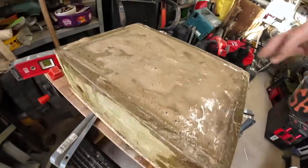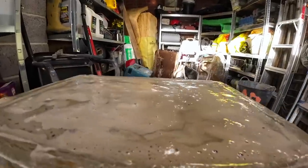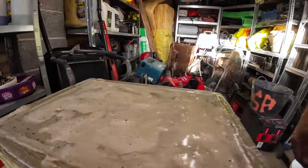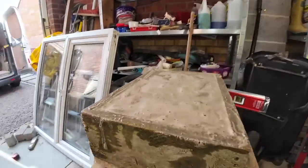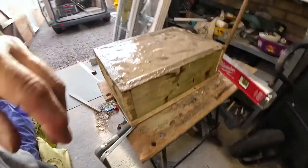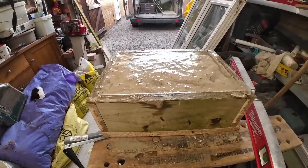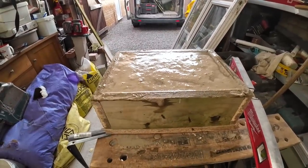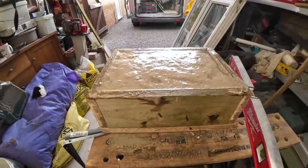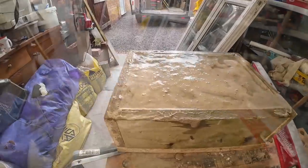The concrete was slightly above the edge of the mould before. If you look now, I have been at it for over half an hour with the hammer and the breaker, bringing the air out of it because the air causes weakness. I'm going to leave the water on the top because that'll help it cure. So it's going to sit in here for 3 days now. Saturday, Sunday, Monday, could be even longer actually. It could be Tuesday, Wednesday, maybe even Thursday before we get the steels. So it's got plenty of time to cure.